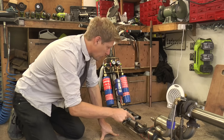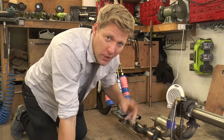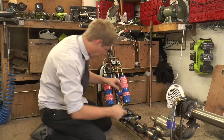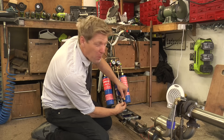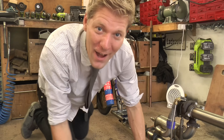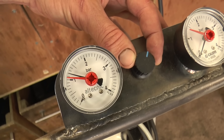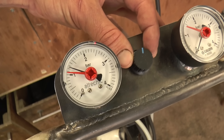Ready for a test. Right, I've put some oil in it. First thing I need to know — can I get any oil pressure on the inlet? So if I just plug this in here, we're looking for around one bar. Yeah, I can hear it. I've nailed that — just under one bar. And we want a bit more oil pressure. Look at that — that is exactly what I'd have ordered. Boom.